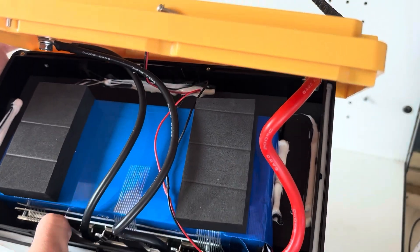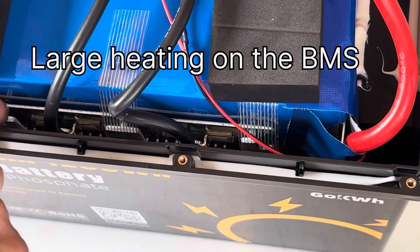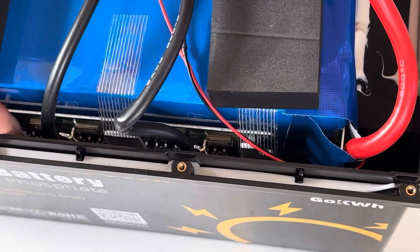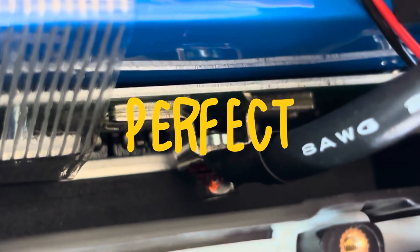There's a big heat sink here, and you can see the BMS. The negative cables look like they're bolted onto the BMS — not soldered, but bolted. That's ideal, because solder can loosen at high temperatures. They've done it properly, lugged it up, and it's got Loctite on it as well. Looks like they've also put Loctite on these terminal post bolts. Overall this feels nice and firm.